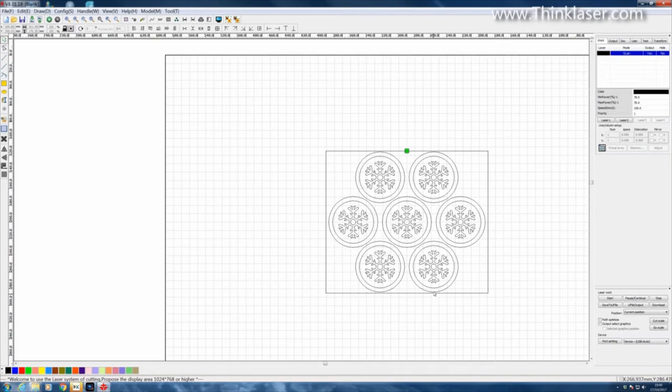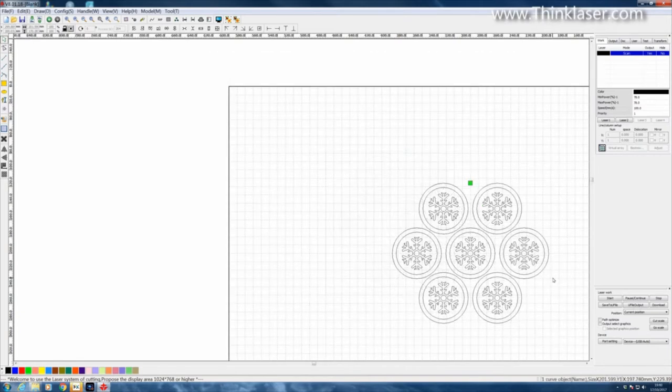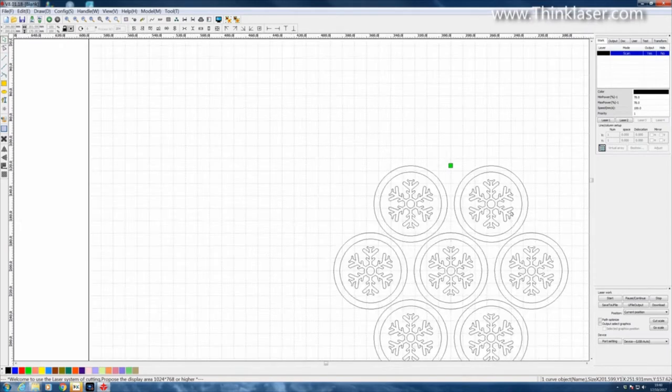Now, the key thing to look at here is the gap at the top and the gap at the bottom. Two very small gaps, which will allow me to have a small amount of mismatch in the pattern without it showing. In other words, if the gap that I finish up with is a little bit bigger or a little bit smaller, it's not an issue. The last thing I really want is for the patterns to overlap. So I can simplify life a lot by making that the whole pattern.